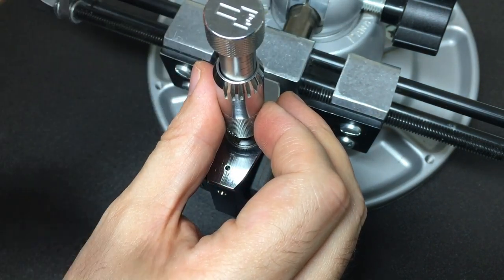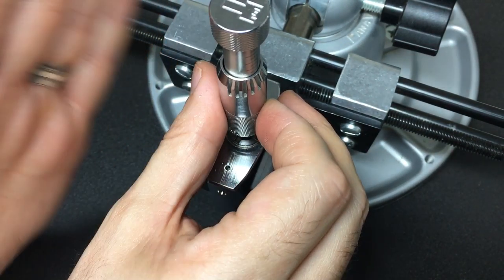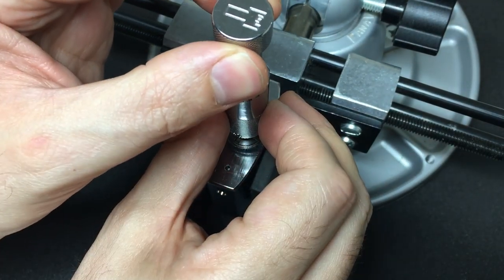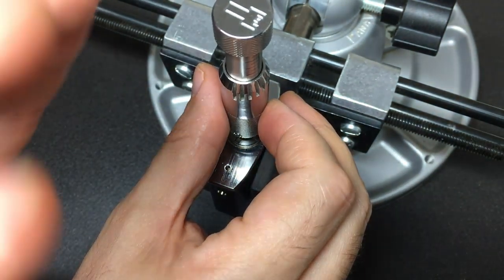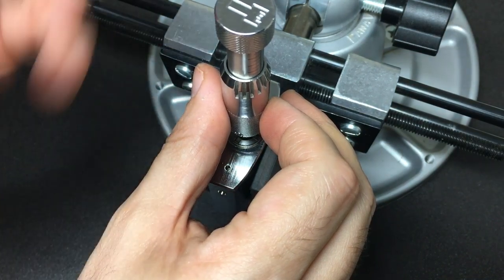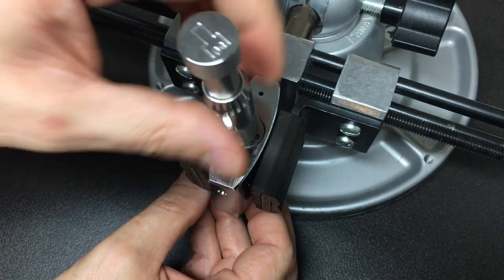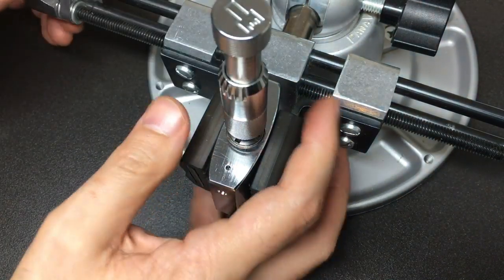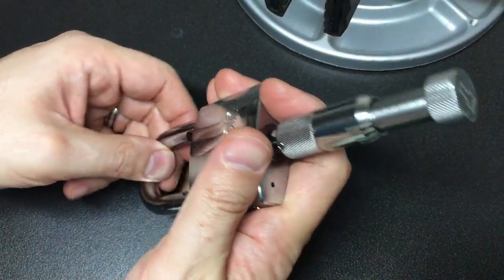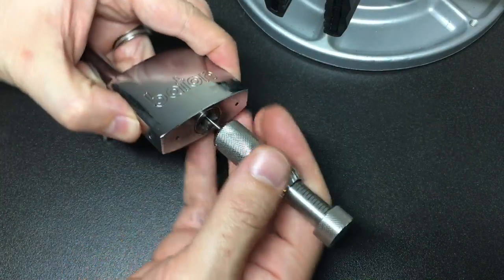It is going to go — there we go, got it picked! It must be rocking that sidebar into the gates, which may or may not have been completely aligned. Sometimes you find when it's all hung up you just rock the tension a bit and you can feel when the core wants to go — it moves more positively. But if it doesn't go, rock it back and forth a bit and you might find it opens. Oh, I think it is open — I just got the whole thing trapped against the end of the vice. There we go. Right, let's quickly disassemble this.